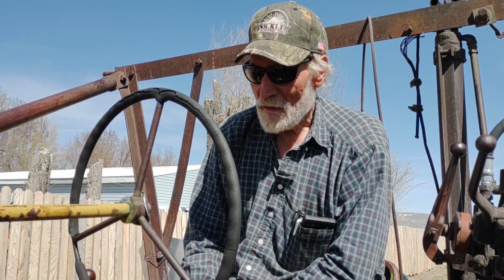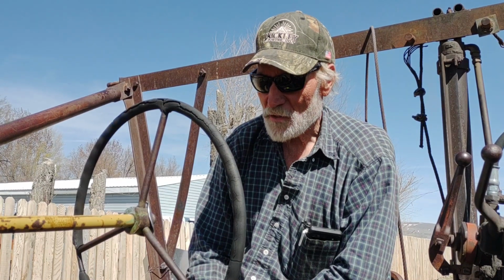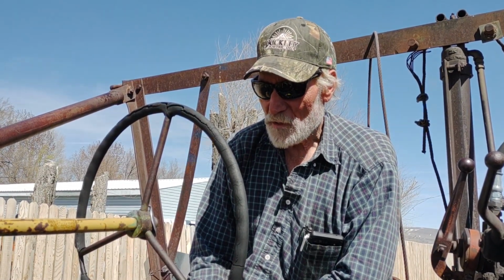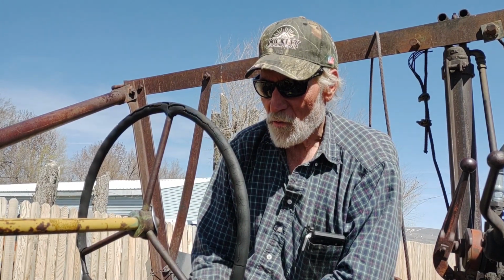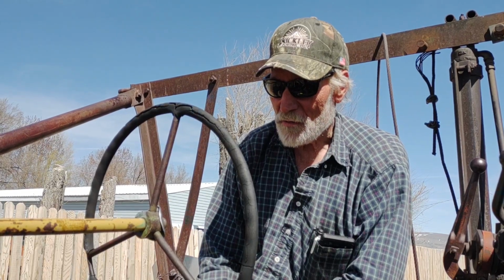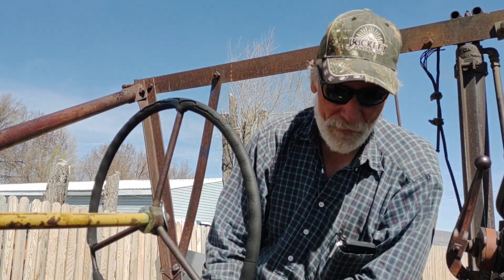And the alternator on it, somebody switched it to an alternator, and the amps are showing good amps on it, although it's going the wrong way, likely because it used to be a positive ground and now they changed it to negative ground.